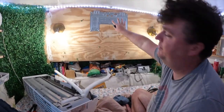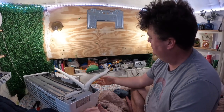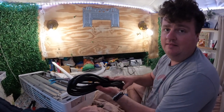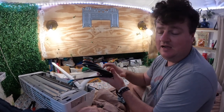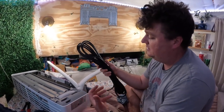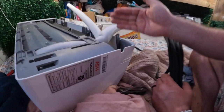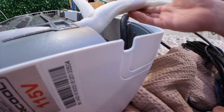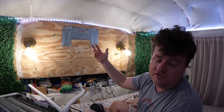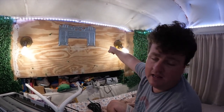We're working on the head unit. Got our plate mounted. The main thing we're trying to figure out is how we want to run the lines. You have two coolant lines, a drain line, and a communication and power line — it's all got to be run down to the outside unit. We're limited on the amount of line we have. I'm cutting out a little side part here because you can swing the line set this way. We're probably just gonna run it on the outside. We have this wall covering here that kind of covers everything up anyway — it's one less step as far as drilling holes and cutting through the plywood.